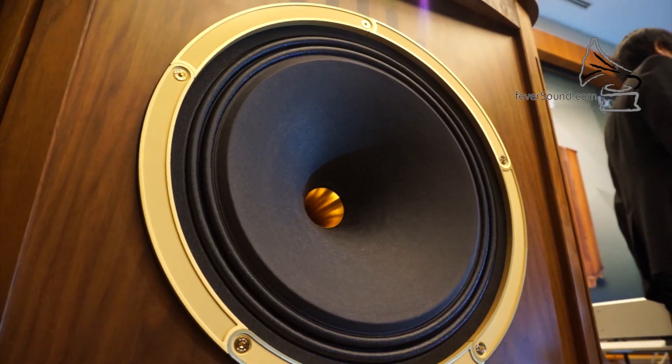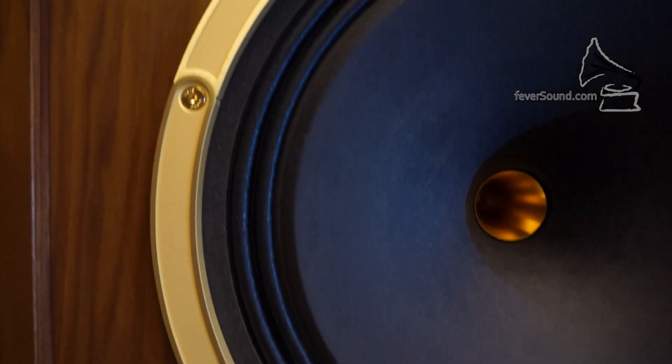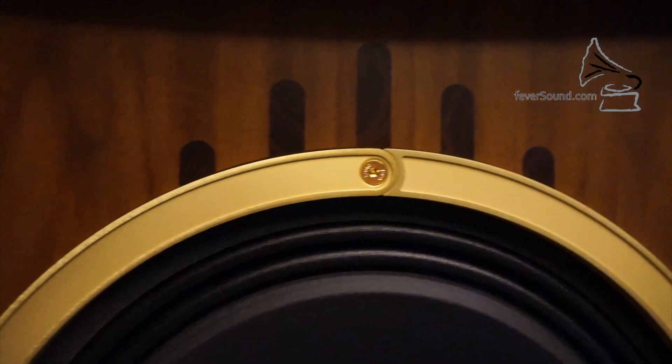The Canterbury has changed fundamentally from a more square trim metal surround to the drive unit, to now a five-piece metal surround, which covers underneath a 10-point fixing for the new 15-inch drive unit. This is a very, very rigid, heavy duty change to that fixing, and when you audition these, you notice the difference sonically.